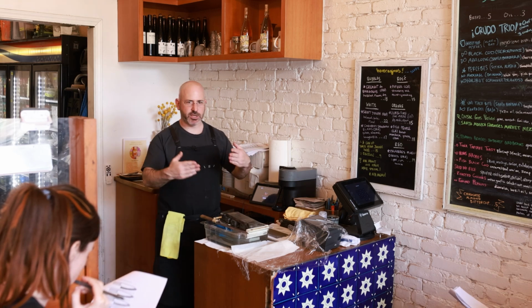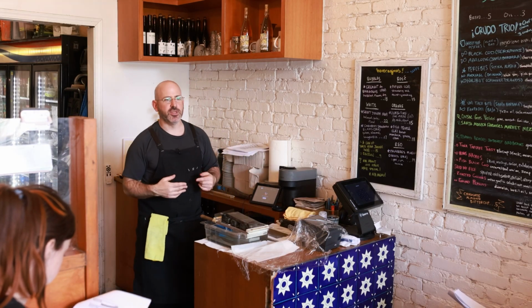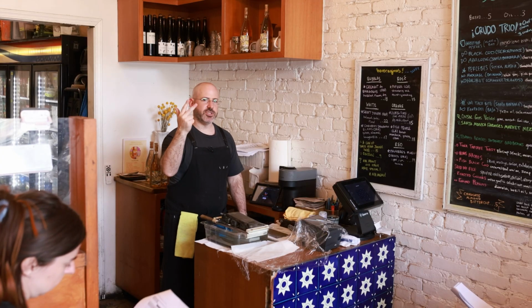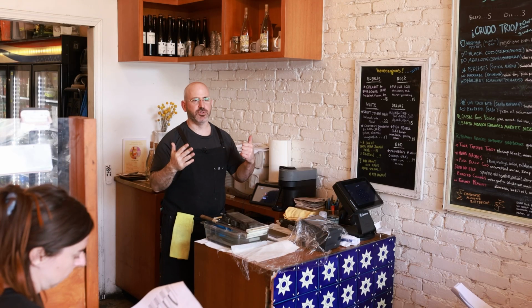You form a big burr in one area, a small burr in another area. We talked about feeling for a burr earlier. Pay attention to that. The other 6 are angle too high, angle too low, under rotation at the tip, over rotation at the tip, not lifting up enough, and lifting up too much. And they all show up in really, really distinct patterns.